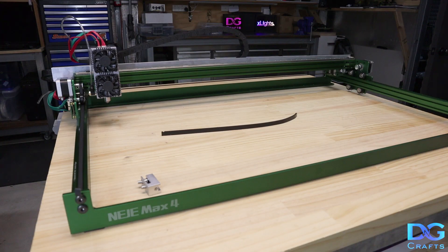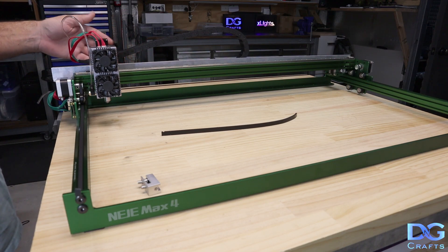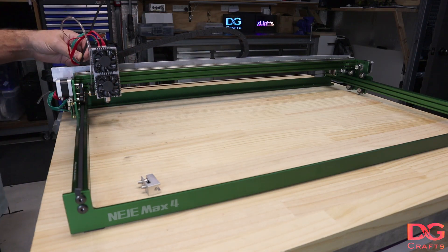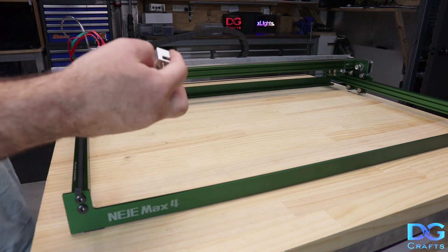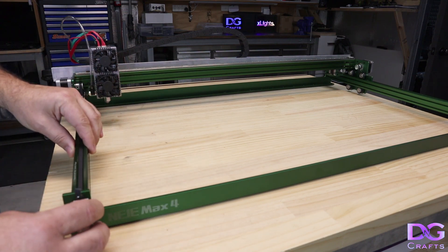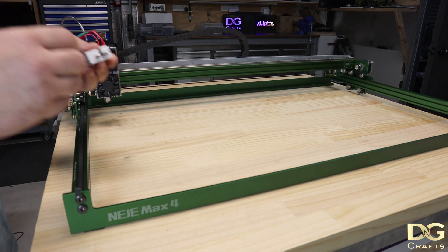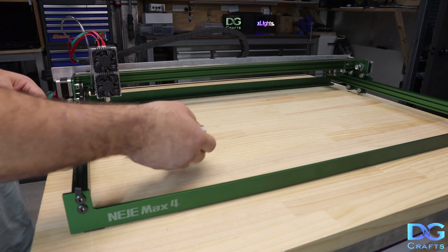We're back after a couple of modifications. I've put the cable chain on the back — they originally had a stick-up for the cable with the idea to just suspend the cable and have it hang down, which is not a very good idea. Some people who've built these before might have noticed I didn't use these brackets, because when you use them on the front, by the time you pass through the front of the aluminium it leaves about two millimeters of thread to screw into the channel and it can literally thread out.